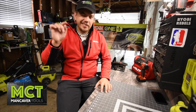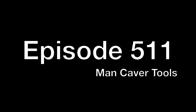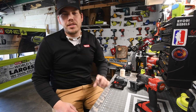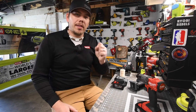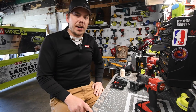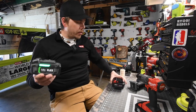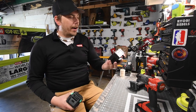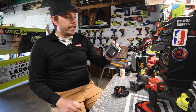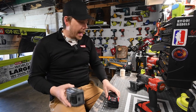Today we're going to touch this topic again — this is going to be a short video. Please don't listen to other YouTube channels telling you what this channel actually is. This channel does not test equal tools; this channel tests fairness. Technically, this 5 amp hour battery and this 5 amp hour battery are not equal at all — this one is 90 watt hours, and this one is 121 watt hours. That's not equal, not even close.